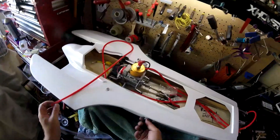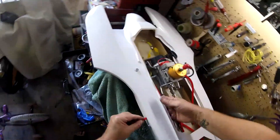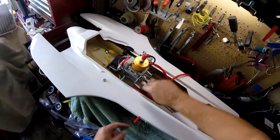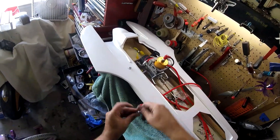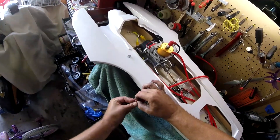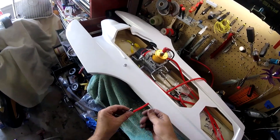How I do these is usually backwards. This is the water output — I'll feed it through the hull first. There's a method to my madness: that way I can get a zip strip around it, because you're never going to get a zip strip around it from the other side. In these I don't even think we're going to need a zip strip, honestly. But you've got to make sure you get all the fittings on first. So we're going to put the nut through, then put this on, slide it in, and bolt everything up.